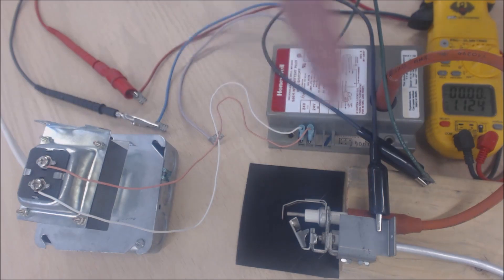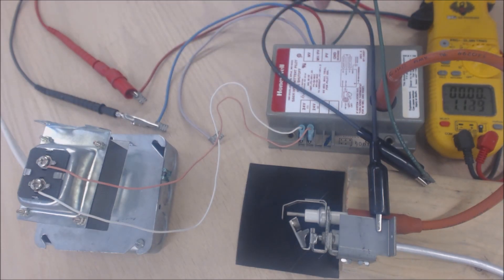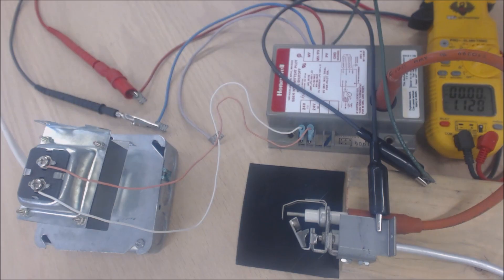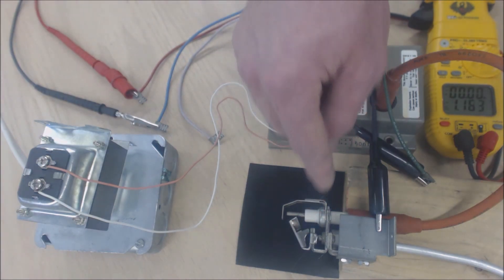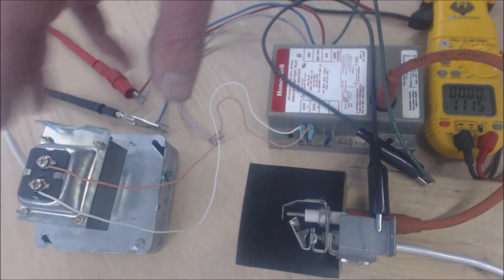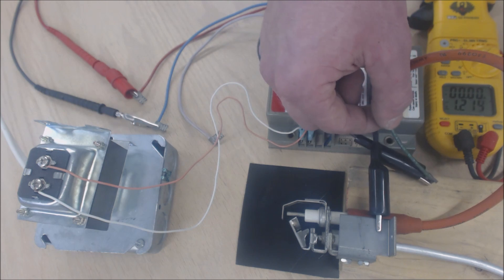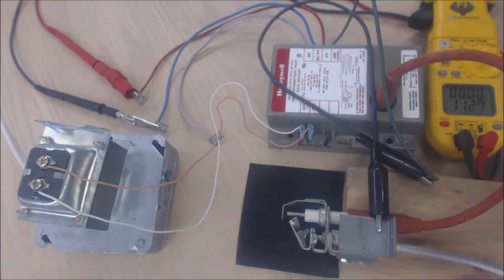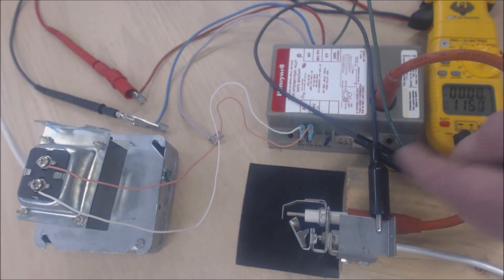It does that for about 90 seconds — it says right on here '90 seconds max trial for pilot ignition.' Some modules will be 120 seconds. If that happens, you can just turn the power off and turn it back on. If you have a flame but you're still not getting voltage to MV to MVPV — going to your gas valve to allow gas to the burners — it's most likely a flame rectification problem. Check this ground, turn the power off, and steel wool this rod to make sure it's clean and making good contact.